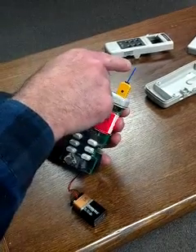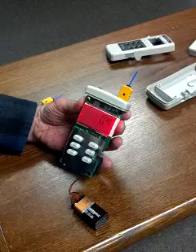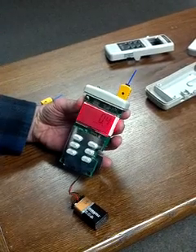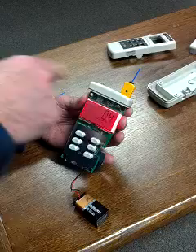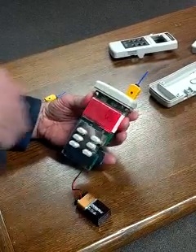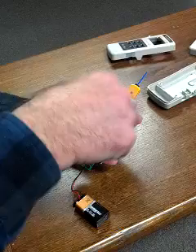At the top, you have a little junction, a little bead. When those two dissimilar metals are combined together, it creates a very minute EMF signal. It goes through a junction in the bottom of the plate here. We do a reference junction for the ambient room temperature.